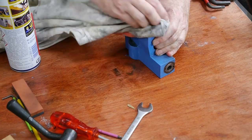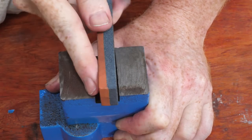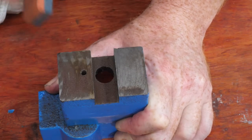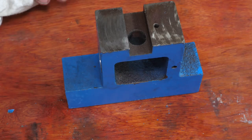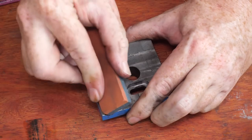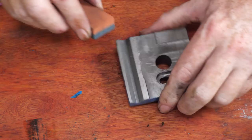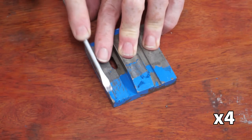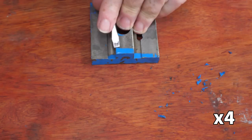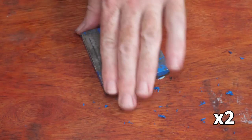The paintwork cleans up okay, but the bottom mounting surface is quite a mess — it's covered in rough machining marks and is very corroded. This surface really needs to be remachined, but at this point I don't know how much material I have to play with, so I'll look at doing this once the machine is back together and I can see whether the tailstock can be made to align with the spindle. The underside of the base rests on the bed but unlike the saddle there's no sign of any ground surfaces, so I don't worry too much about stoning the burrs carefully. The top side of the base is where the main body of the tailstock rests, so I need to clear up the paint to make sure of good contact. The overall quality of the tailstock is so bad I'm not even sure it's recoverable, but I'm going to keep working on it as it's part of the lathe package.